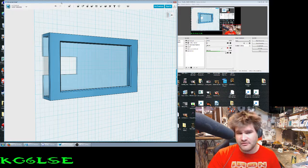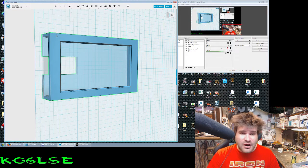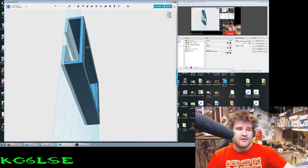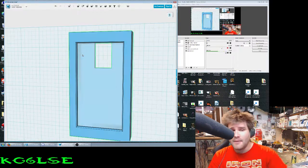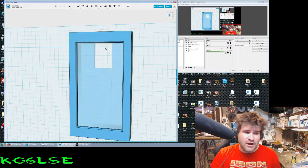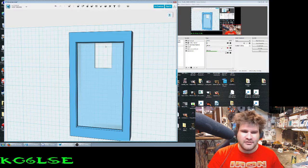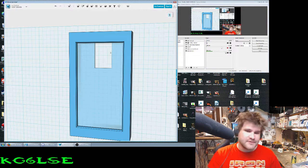I'm making an outer skin for it. Dimensions are going to be 3mm thick walls. I'm just going to print them permanently solid. I'm going to print, of course, like this from the bottom up. I will have some droop around here, but I don't care. That's what a torch is for. And honestly, even if that was missing, I may just cut it out with a pair of cutters. It won't even matter. So, there you go.